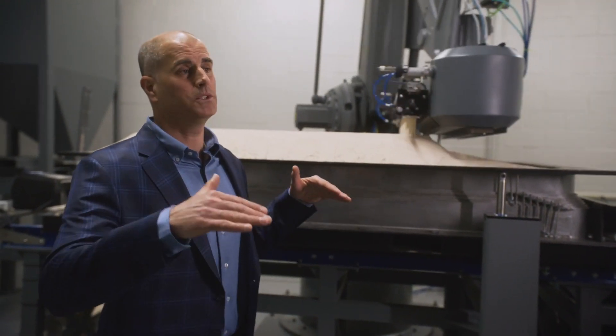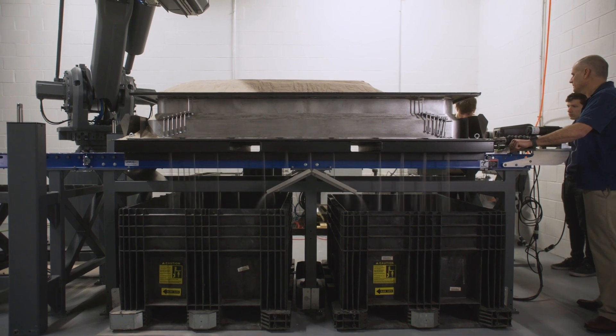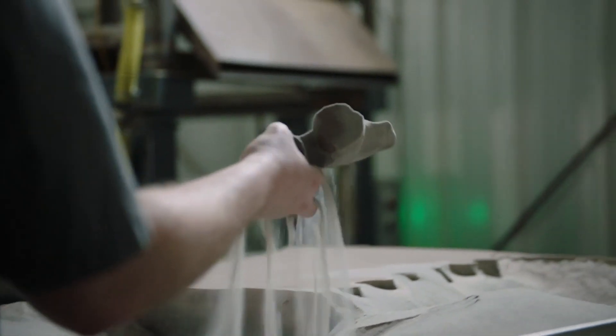At the top of that, once you get to that one meter and you've completed your build, you can then pull the gate valve. The gate valve opens up. All the unbound sand falls out of the bottom, exposing your printed part, and then you remove the printed parts and start your depowdering process.